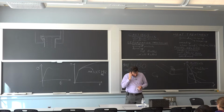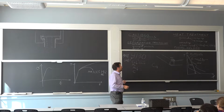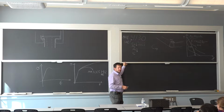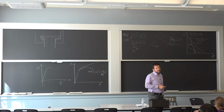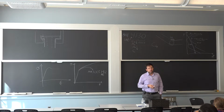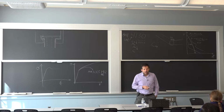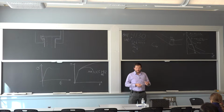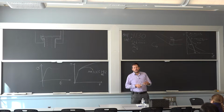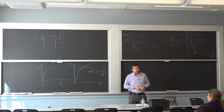So that's really how, I guess, after a few time talking with Jimmy, we realized that we didn't understand why you can do it without the risk of having a low ductility. What is the formula for carbon equivalent? There's some formula, mathematical formula? Yeah, for the carbon equivalent, there are 2 or 3 formulas, depending if it's AWS or SAE. They all have their own slightly different ways. It's not a perfect system, but it really gives you a good starting point.